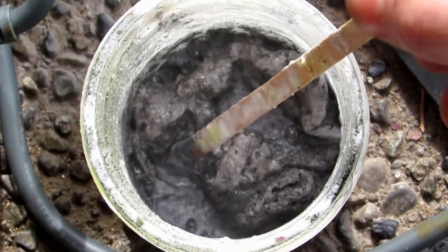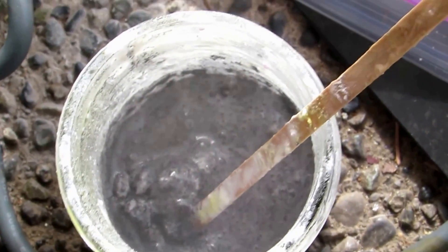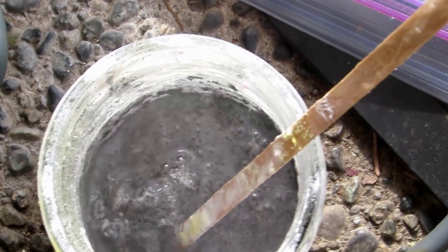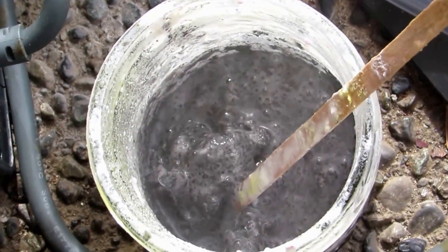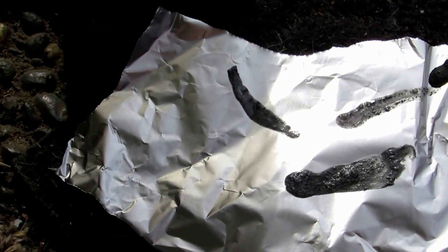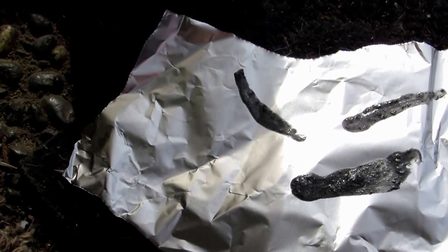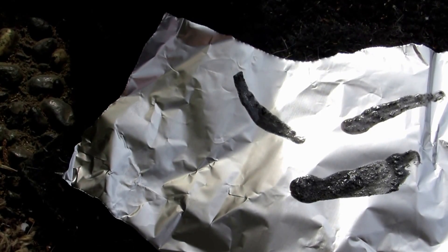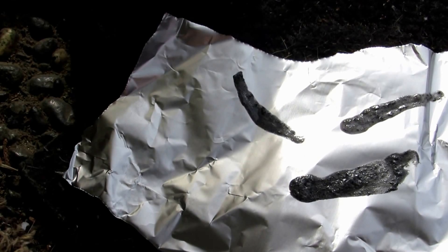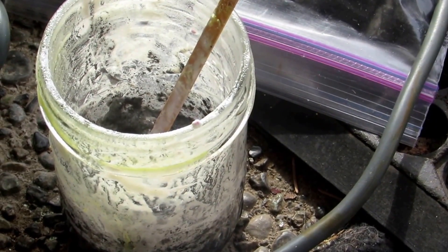You can see the mixture in there. I've added some aluminum foil — you can see bits of aluminum foil in there. That's displacing the bismuth, creating black bismuth metal in very fine form, and aluminum chloride which is in solution. What we will do is continue adding aluminum foil until, when you make a streak on a piece of aluminum foil, it should be pretty light. But if it darkens up after a moment, that means there's still bismuth in solution, because it will still exchange places with the aluminum. So you'll just want to keep adding aluminum. Once that stops, you know you have all your bismuth out. I'm not even going to try to calculate a yield because it's going to be extremely low due to all the losses we've had. I would like to retry this in the future. The next step is just going to be to keep adding aluminum foil, and I'll be back when no more can be added.